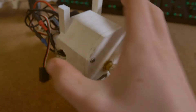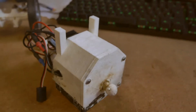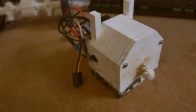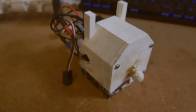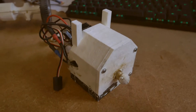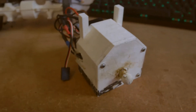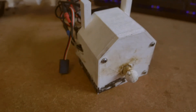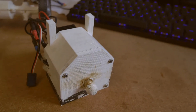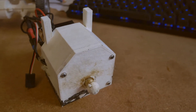It's a bit noisy because originally the gear was going to be one size and then the teeth were the right size. But then it skipped — for some reason it just skipped on the other gear, so I had to make the gear 5% bigger. But I forgot to actually add another tooth in, which it needs, so it's a bit on the noisy side. It's only under load — actually it's reasonably quiet compared to my other trucks. When it's going along on a flat piece of road and gets up to about 6 miles per hour, it actually begins to settle down and is quite quiet.